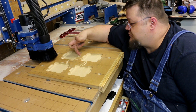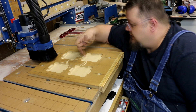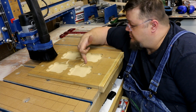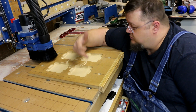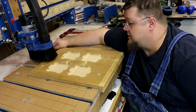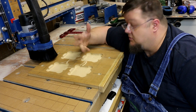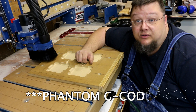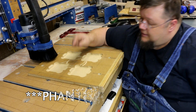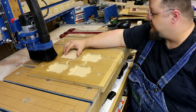Here's the interesting thing: I stopped the machine because I saw it doing some kind of circle which I have no idea where that came from. I used the same file, opened the same file multiple times — it was cutting the G-code for these pockets just fine, came to this pocket, pocketed down once, and somehow started cutting circles. I reloaded the G-code and started it back up — it ran through fine, no circle. I don't know where the circle came from; it's not in the G-code that I can see. I don't believe it's going to have an impact on the use of the jig.